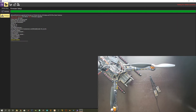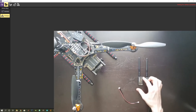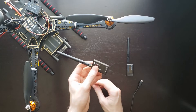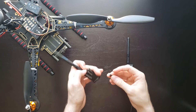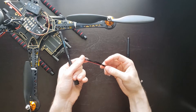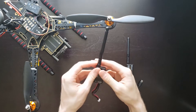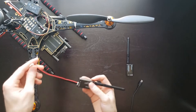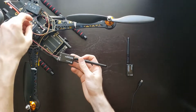Once the upgrade is complete you can unplug your first radio and then follow the exact same steps to update the firmware of your second radio. With the firmware updated on both radios, we're going to attach them to the quadcopter and the ground control station. Take your first radio — this is the one that attaches to your vehicle — and grab the six-wire cable that comes with the kit. Plug that into the radio and plug the other end into the telem1 or telem2 port on the Pixhawk 4 flight controller.